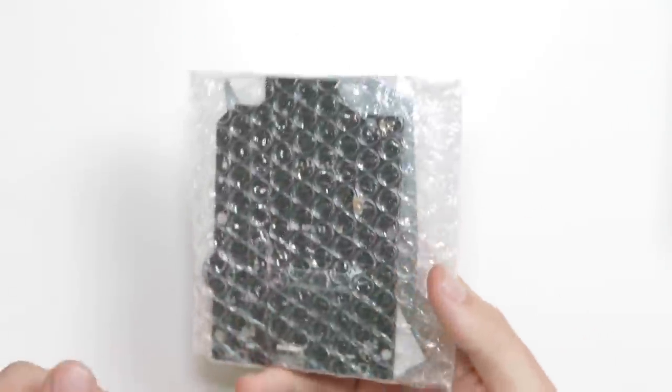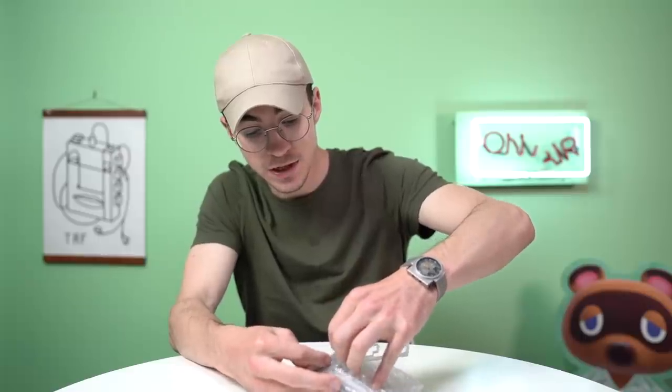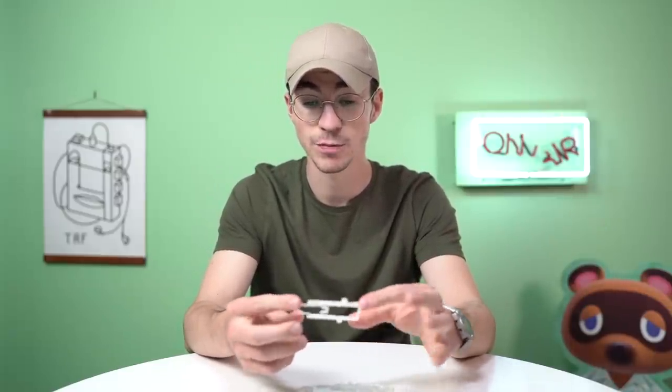I thought this would be a great idea to take a look at the brand new IPS screen. This is the V3 edition, so there's a few changes and a couple of things that are sort of new. One of them is a 3D printed bracket which is taped very well onto the packaging. This 3D printed bracket supposedly is going to help us with this entire process. If you remember correctly when I did the first Ultimate Game Boy build, the IPS screen used meant you had to reverse some of the traces because one of the grayscale gradients had reversed, which meant you had to be quite specialist to actually install it.